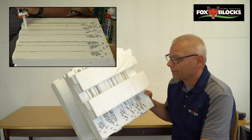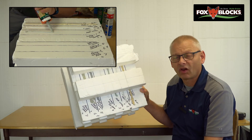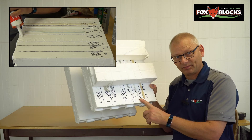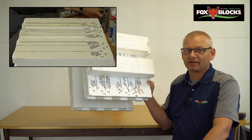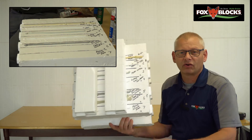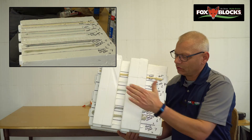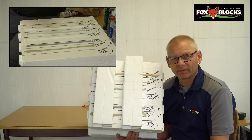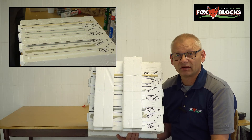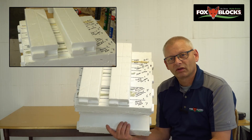The reason I did that is when you trap any kind of sealant that has a silicone or solvent base, that solvent might eat the EPS — or it might not. You've got to test it. If you have a product and you don't know if it's going to work, test it and do exactly what I'm doing. I did two samples for each because some take seven days to cure, some take one day, and some say you can paint them in an hour. So I'm going to start peeling them off and we'll see what it looks like.